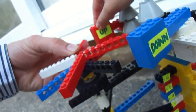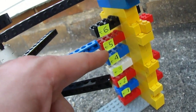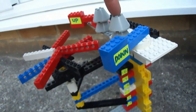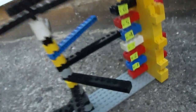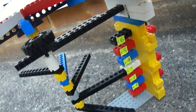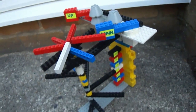Now let's say it's stopped and the doors have opened. So now it's at the fifth floor. The controller knows it's at the fifth floor because this switch is activated. Now it's going to go down. It's going to send a pulse to this electromagnet, and that's going to move this in and push the whole thing the other way. So now it's at the fourth floor. That goes back to where it was. And then it goes down another level, and that pushes that down to the third floor. And that's how an express lift floor selector works.